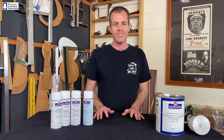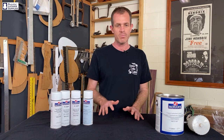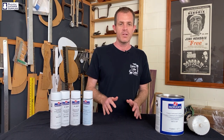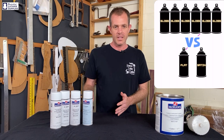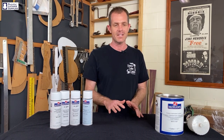To give you a rough idea of the difference in time and amount of product used: a flat or satin finish can be applied in half a day — it just needs one session of coats, a light sand and then another session of coats to finish it off. A gloss finish on the other hand needs more like five days of spraying, and then you have to let the guitar cure for about a week before spending at least a day cutting it back and polishing it. You also use a lot more product with gloss — around six aerosol cans for an acoustic guitar compared to only around one can of flat or satin. Gloss also needs grain filling before spraying the timber, whereas flat or satin doesn't necessarily need that.